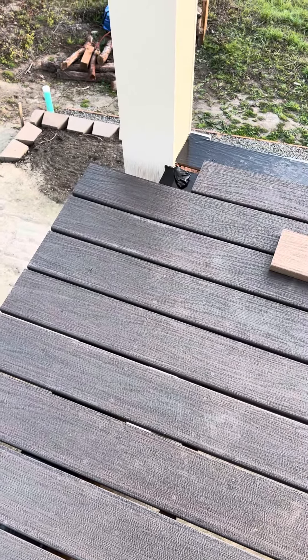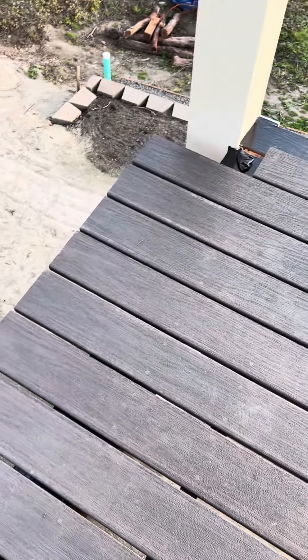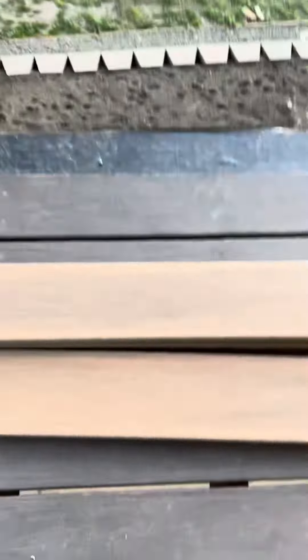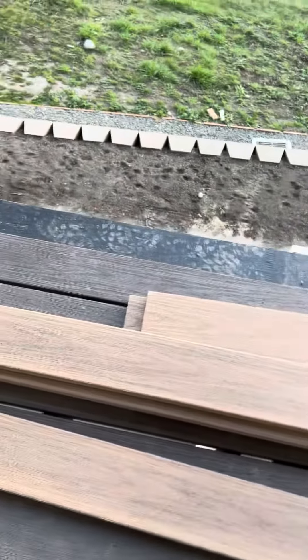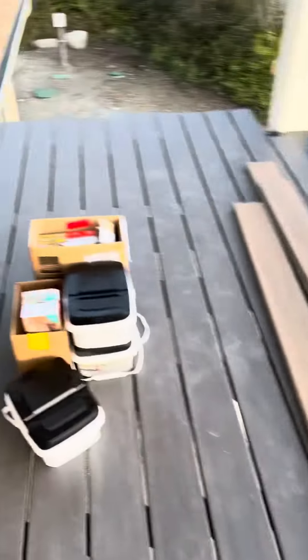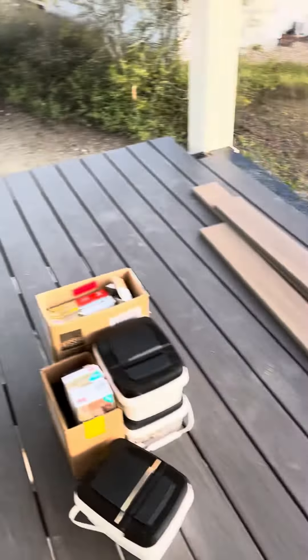For our posts for our cable rail, it also acts as our picture frame board support. You can see the different color here — that's gonna be our border. It's a plug system, so there are barely any visible screws, and then it's gonna get the same brown fascia. This one's gonna be aluminum posts with stainless steel cable rail — that's where we're at.